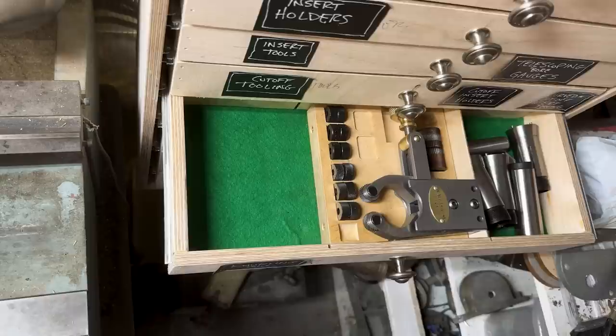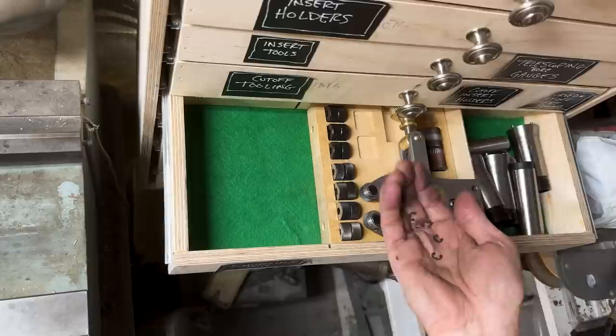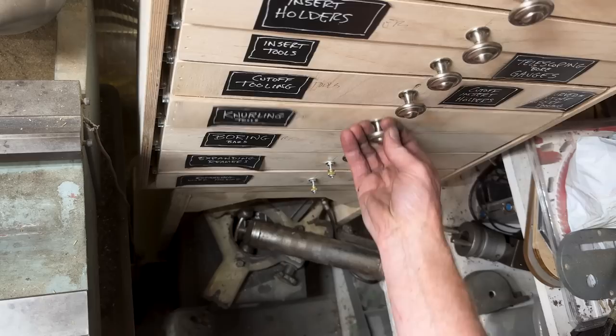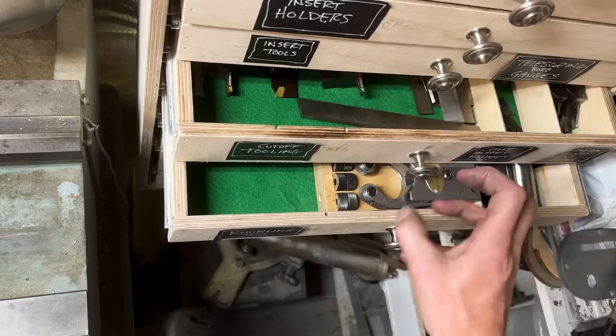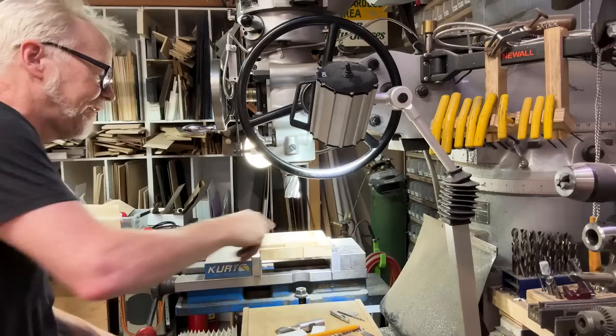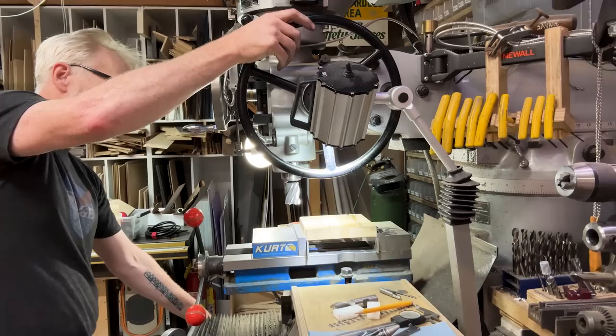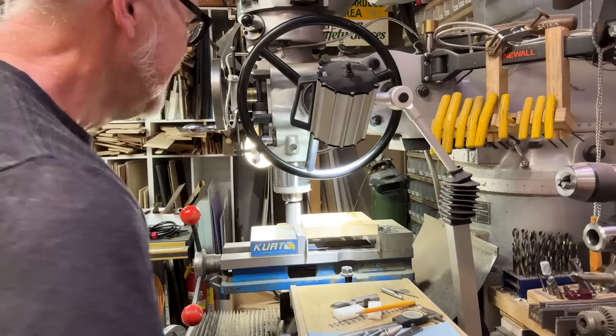I have extras here. I don't need them all, which is fine. Oh, right, circlips. All right. Here we go. That's it. Five extras. There we are. Now, are you kidding me? It's bumping the... All right. So I'm just going to take off about 250 thousandths off of the bottom of this thing. I'm going to use this same bit because it's plenty. Let's start with this end because that's the most delicate chunk.